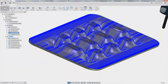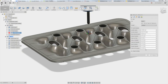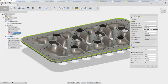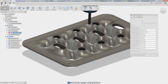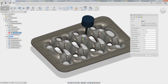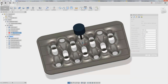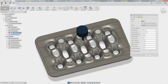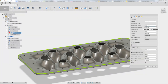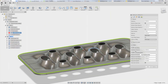So this parallel — let's take a look. Looks beautiful. There's no real lead-in to speak of, so a lot of this probably comes down to step over. The first thing I would probably do, looking at this, is there aren't too many tight inside radius type things. So the best thing would probably be to switch to a quarter-inch or three-eighths-inch ball end mill. With the larger diameter ball, you're actually going to be able to do a bigger step over and have less scalloping, so better even resolution. I noticed he had feed optimization turned on — this is a really cool thing where you slow down the feed rate of the machine when going into a corner.